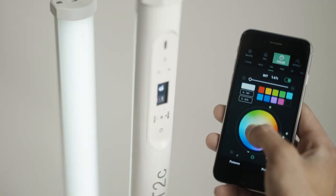Now let's talk about output and color quality. Amaran is no stranger to colored lighting. From our panel lights like the P60C to our new LED strip lights, we've always wanted to make colored lighting accessible to a broader audience, and we felt that tube lights were the best next step towards achieving that goal. Though tube lights may not be known for being the brightest light source, they are known for their color capabilities. With a wide 2700K to 10,000K CCT range and 360 degrees of hue control, the fixtures in the Pixel Tube lineup have CRI scores of 95, TLCI of 98, daylight SSI of 75, and tungsten SSI of 85. Other helpful features include fully tunable green-magenta shift and advanced white point control in HSI mode, helping ensure total control over your color reproduction.